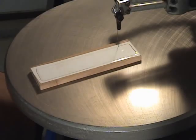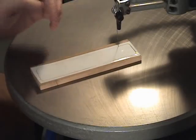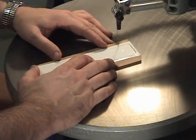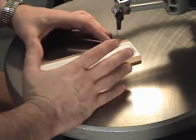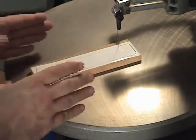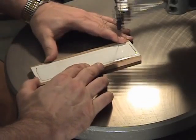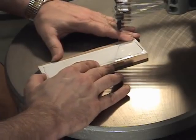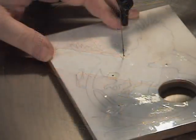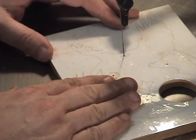I've stopped this cut to show you something that if you're new to scroll sawing, it's one of the first obstacles you'll need to learn to overcome. My blade is parallel to the scroll saw arm, but the wood is actually at an angle — that's because all scroll saws cut at a slight angle. After you've used your saw for a while, you'll get the feel for it. One tip is to move your chair a little to the right side of the blade so as you're pushing the wood, you'll feel like you're pushing straight. I've got the base cut and now we're ready to move on to the main body of the clock.